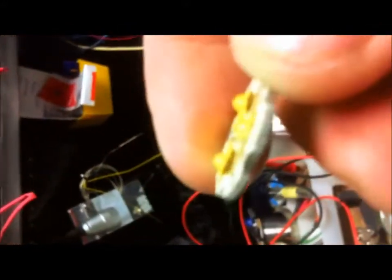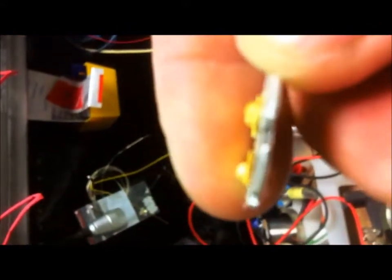You want to look at it at that flat angle I mentioned earlier. I actually think I have a little lifting with that second LED as well. What you can do while soldering is physically push down and put some pressure on it — normally I don't need to.